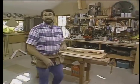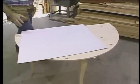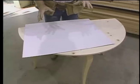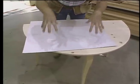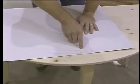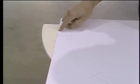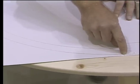First thing that I did when I started this project was make a full-scale pattern from which I could lay things out throughout the project. If you could look through this pattern, through the tabletop, the top of the leg would be right here, the center leg, which is this marking. Over here is one of the end legs, and these two lines represent the inside and outside of the rail.